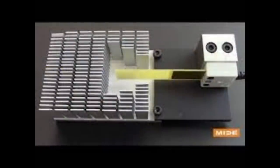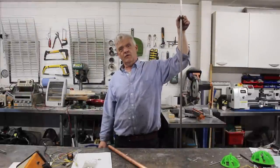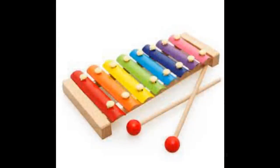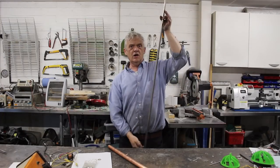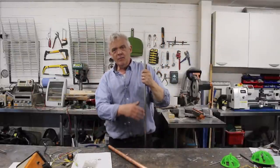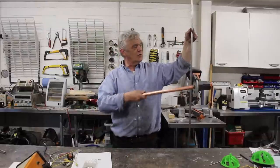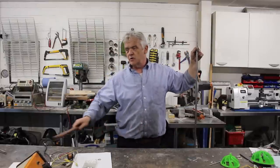If you have a look at a piezoelectric fan you'll see that it's essentially held in one spot, and in musical terms this is called a clamped vibration bar — so we've got one clamp on it. In a glockenspiel or xylophone it's clamped on both sides, as it is with a guitar where you've got the nut and the bridge. In a tubular bell you're hanging it so it's really free, but you can think of it as clamped at one end. So with a single clamp on a bar, we take the piezoelectric element and hit it — the actuator — and it rings at the fundamental frequency, giving the biggest range of movement.